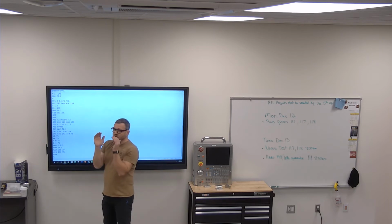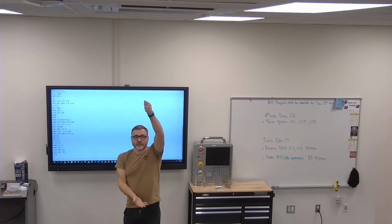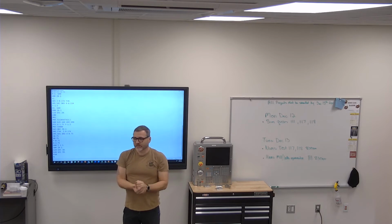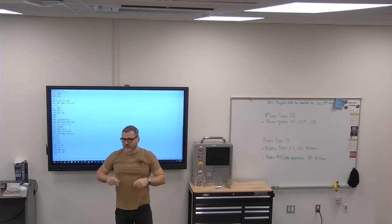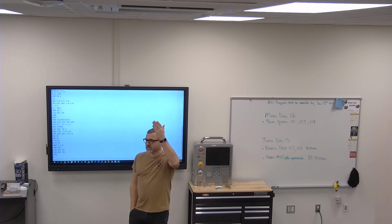When you combine G28 and G91 together, they tell the spindle to go all the way up. G91 by itself says go incremental. G28 by itself says axis go home. So we're going to do both of these things together and incrementally move Z all the way up. You've got to have those two codes together, Z0, to spin all the way up.